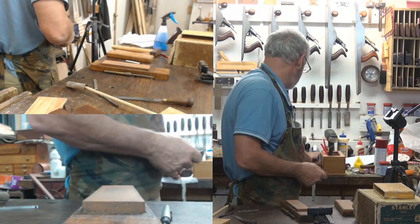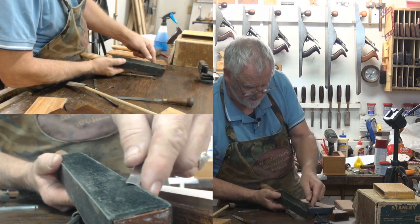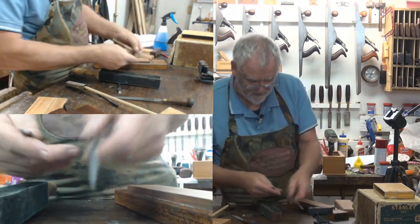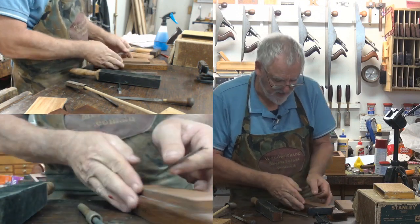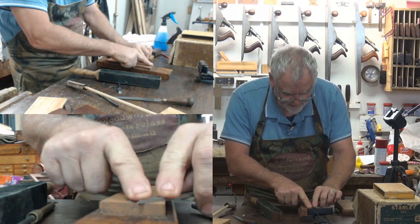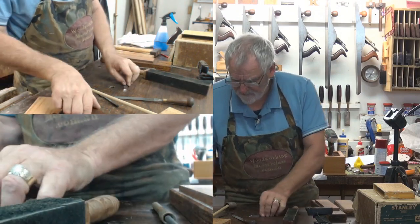If you've got leather strop, just give it a rub on the strop and around the inside there, if you can. It's quite easy to make a round strop if you had to. Now, the difference between these and the 45s, exactly the same thing, where you can use this on the 45. But then you've got two shoulders here. So you sharpen that the same way as a straight blade. Put it on the stone, pick it up, get the discoloration, lean forward, give it a couple of even strokes, and then flatten all of it off in one go, and that'll sharpen those. So that's round and hollow. Snipe bills I'll do later on, but we'll set these up to see if they're going to work now.